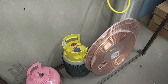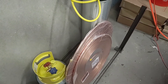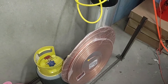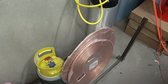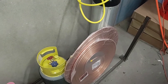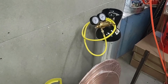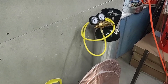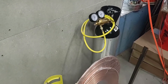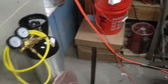Since I am going to be installing this outside and it's going to be about 20 feet between the evaporator and condenser, I got some copper line to install for that. I also have a nitrogen tank so I can fill this system while it's open so it doesn't have air in it, which would cause problems with the compressor oil. Nitrogen also helps with the soldering or brazing of the copper joints.